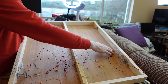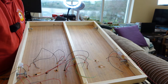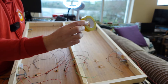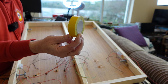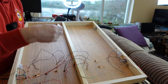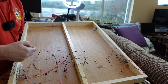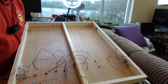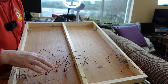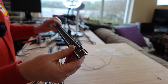Where the power comes in I'll write on the board which wire is which and what they do. Each bus will get a bit of insulation tape of a different color put around it, and written on the board it'll say yellow is DCC bus, green or black is the point supply or 12 volt DC supply. When you're under the board looking, you can quickly see which wire is which - it just makes it easier for fault finding.